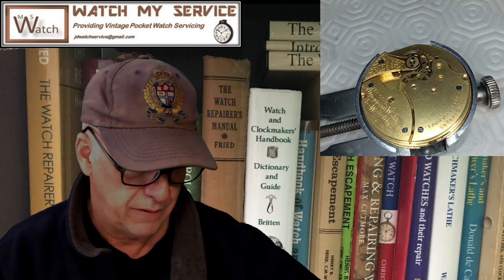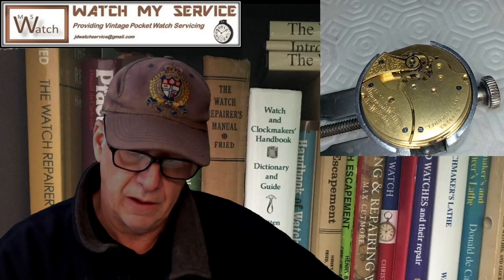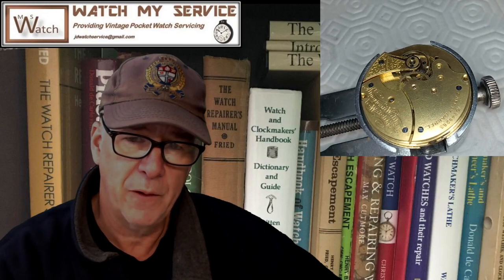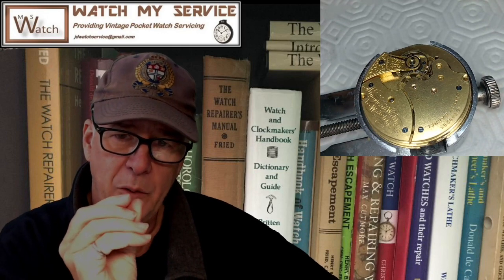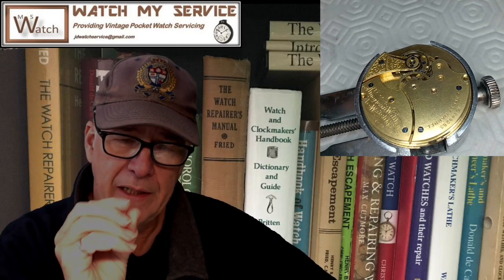What I'm going to do in this video is recase the movement. It was magnetized, as I showed in the previous video, and I showed how to demagnetize it — that worked perfectly. If a watch's hairspring is magnetized it can cause the coils to bunch up underneath the balance. Also, if you look underneath the balance with a stereo microscope, sometimes you'll see two parts of the hairspring actually touching — bunched up and hidden by the balance cock.